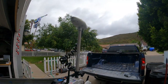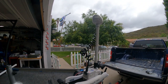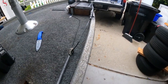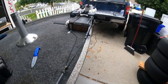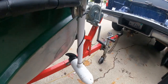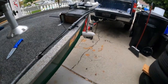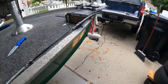No issues since I got the new remote — it's rechargeable, so no problems there. You can see how that cable just follows the motor as it turns because I've got it zip-tied down — not tight. As you turn it, it pulls that spring a little bit tighter, and you can barely see it moving but that motor is turning, wrapping that cable around the shaft. When you go back the other way, the spring just pulls it back up and keeps tension on that line so there's never any slack to get caught up anywhere. A really nice feature I built into this.